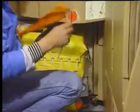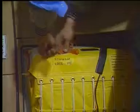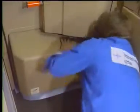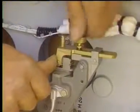Remove the lock pin assembly from the operating head of the slide raft inflation reservoir and put the lock pin assembly in the stowage pocket installed on the pack assembly soft cover. Put the pack assembly decorative cover in position. Connect the cover attach straps. Check the indication of the decorative cover brackets and girt bar visual indicator. Make sure that the operation striker lever of the door damper and emergency operation cylinder is in the armed position.